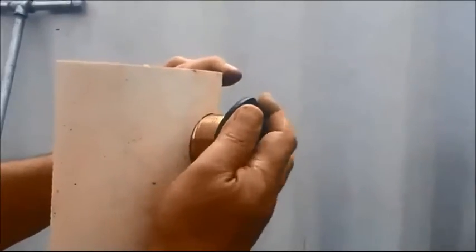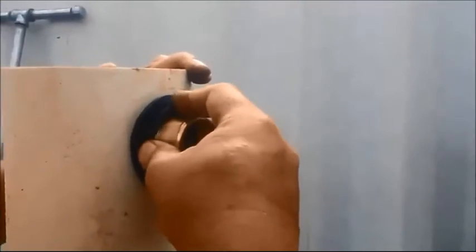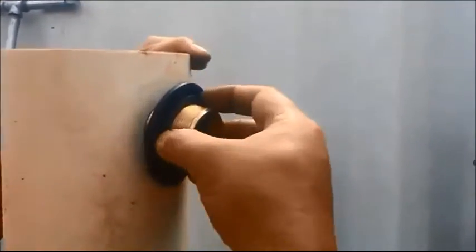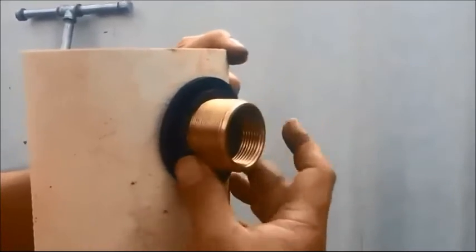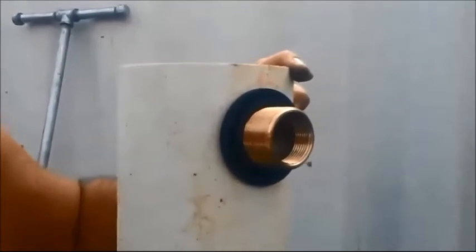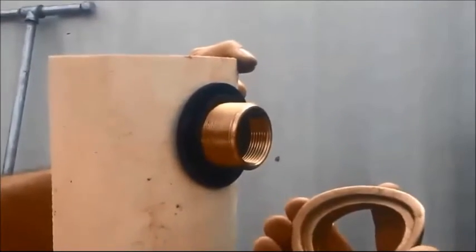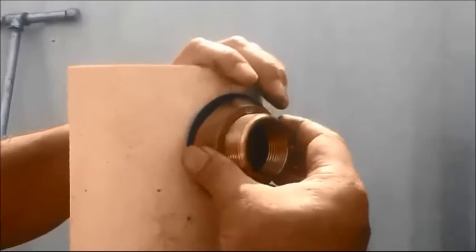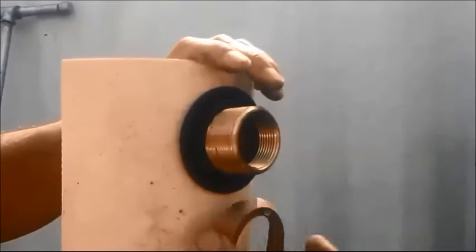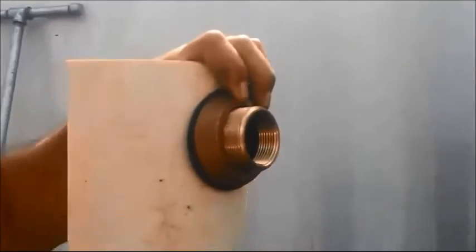There is also an exterior gasket that's going to provide a seal against any groundwater infiltration into your well. It fits with a backing plate that pushes up against the outside of the casing. This is curved to accommodate six-inch and up — this happens to be a six-inch piece of pipe, as is our well casing — and it's going to compress that gasket to provide two seals.